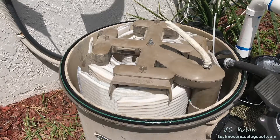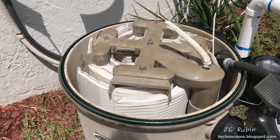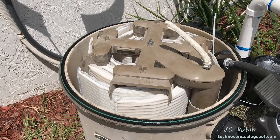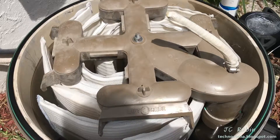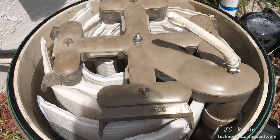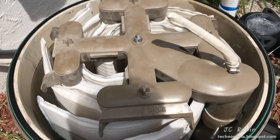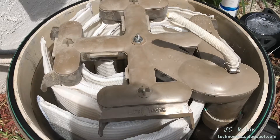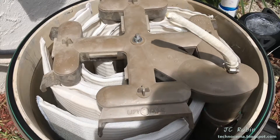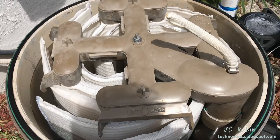For the next step, I'll be using the hose to fill up the canister — at least about halfway. I don't want the whole thing dry and have the pump having to fill it up. This is just something that I do. This is sufficiently filled with water now. I thought it'd just take a second to look at the after of this project — it looks like brand new filter elements in a brand new system. It's come a long way since we started this clean out. Let's close it up.